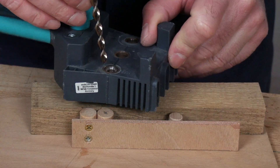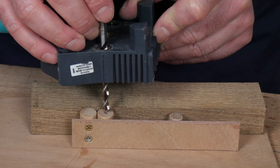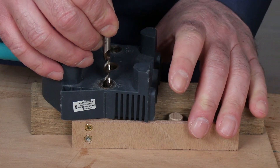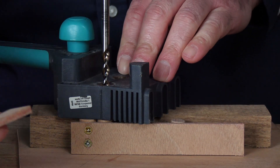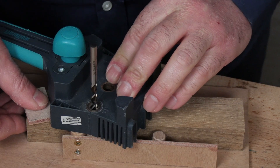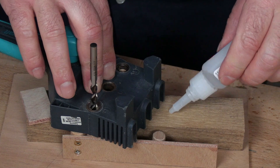And it will help me keep the doweling jig fixed. On the pieces I want to drill, I mark the center, and I mark it with a drill bit tip, as we'll see right away. So now I can first place the drill bit in its spot. I bring the stop block against the back of the jig. And similar to how I did in the video where I drilled the ends of the rods, I thought it was a good idea to glue some stop blocks to the sides of the drilling jig.